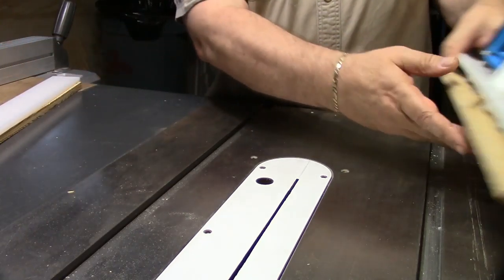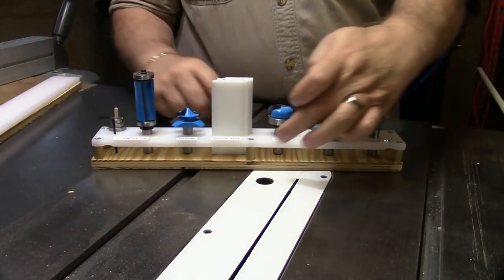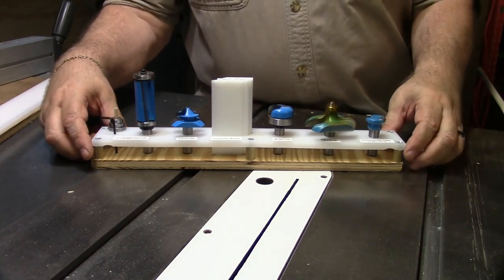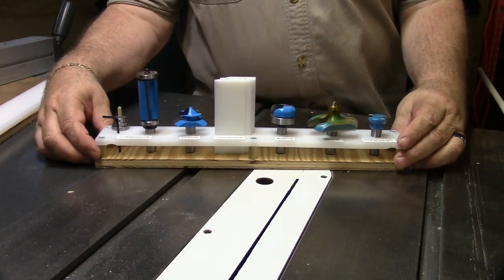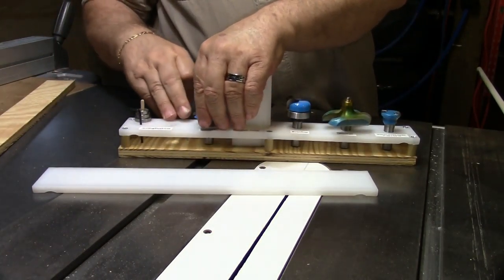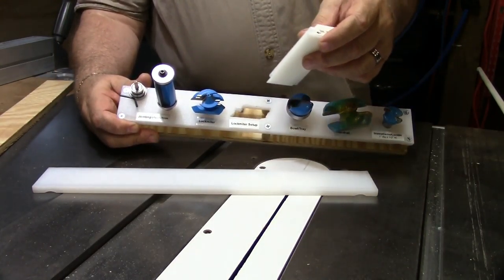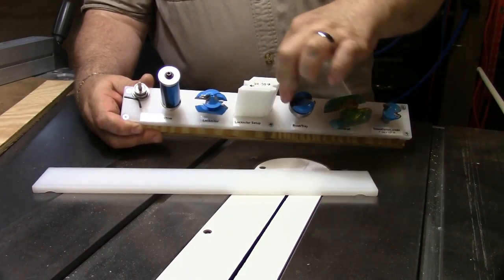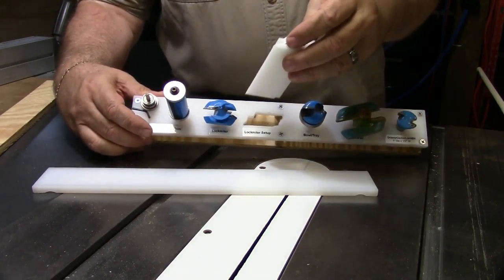Then what it's going to look like when I get done is this — this is a finished piece. I've got six dowels in here: four at the ends, two in the centers. The screws I'm using for those are number 8 by 1.5 inch flat heads, and I've shaped out for the heads so they'll sit flush. Then, once I've got that to that size, I take the flat piece over to the drill press and cut out the holes. I lay out my bits to determine where I want my holes and so forth. For the shape of this — this is for a lock miter set up — so it's an oddball shape, not a round thing. I traced out the shape around a piece there, drilled a hole in the middle, then went to the scroll saw to cut out the shape. The scroll saw is the one where the blade moves up and down like a sewing machine — much easier to control. You could do this with a jigsaw, but that would be kind of a tricky situation to try and get a good cut.